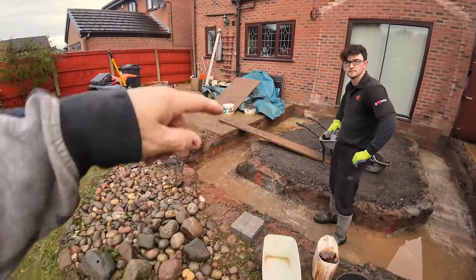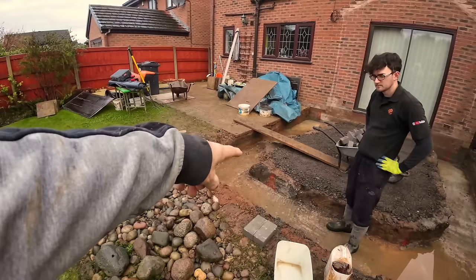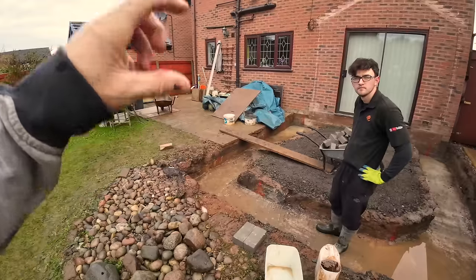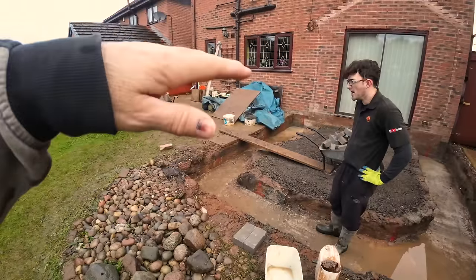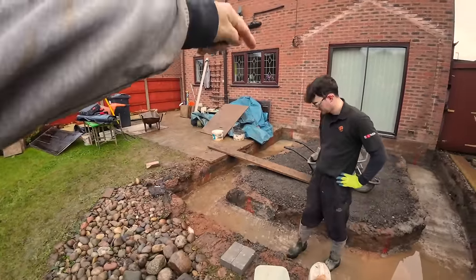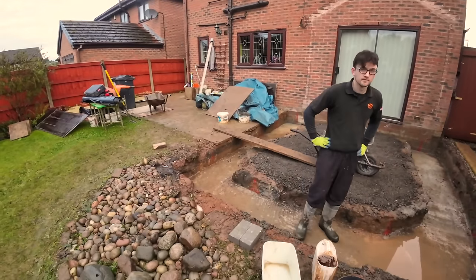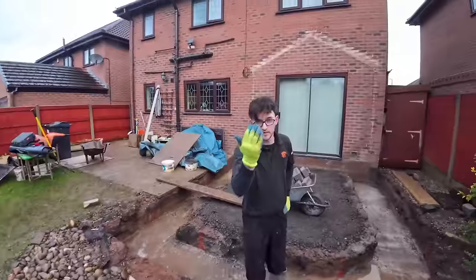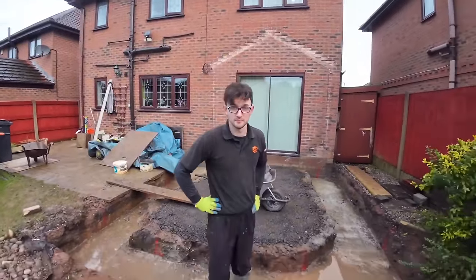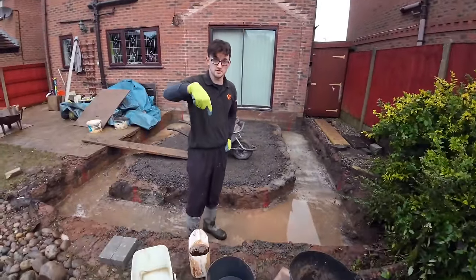Obviously we're putting a 7-newton block flat across the door. There's no need for a trench block there, because all that goes across there is the brickwork up to damp and the slab. That's it. There's nothing above that, obviously, until you get to the lintel. So there's no weight across that section, even though it's still got 750 mil. And the building inspector okayed it, so if you've got a problem, go talk to him. We're going off building regulations approval here.